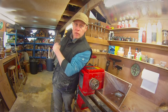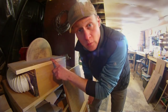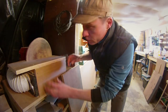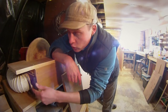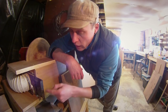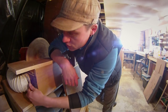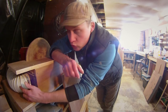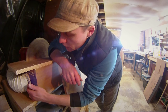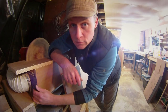Here we are at the sanding wheel, which is the head of my very first lathe. I've got a plywood wheel and I've built a box for it. At the end of the box I've got a blast gate which takes as much of the dust as possible away from the sanding wheel. These blast gates I've got from Axminster Tool and Machinery. Attached to that is some tumble dryer hose — it's four inches, so a hundred mil in UK metric measurements — and that's just attached on there with a Jubilee hose clip.